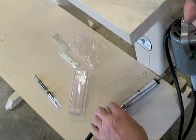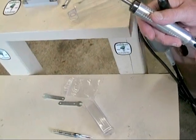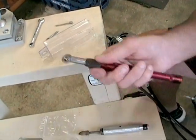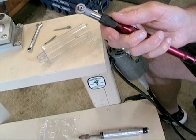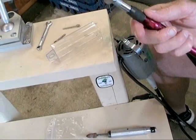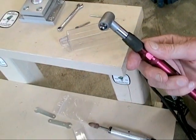Always be careful when plugging and unplugging your hand pieces. Give it your foot pedal just a little bit of gas to get that shaft lined up. Same way going back on — it just pops right in there and then it'll pop right on. If you just try to force it in, you're either going to bend your shaft or put everything in a bind.